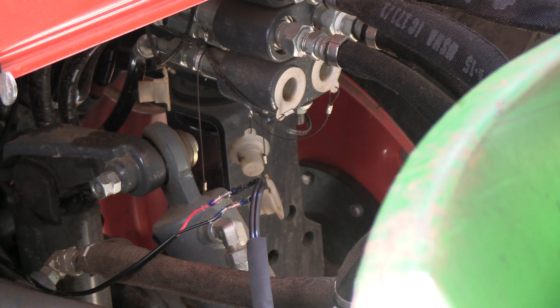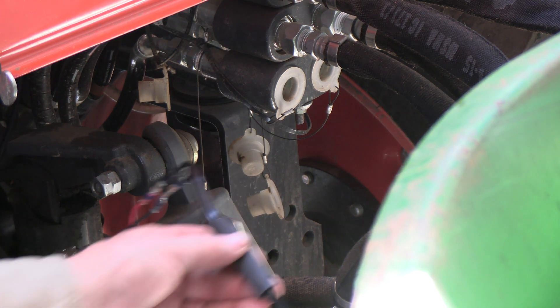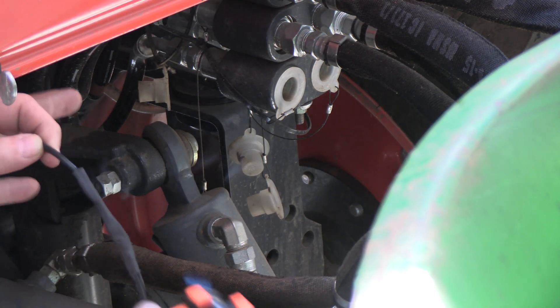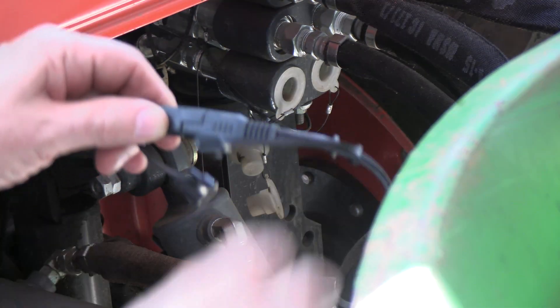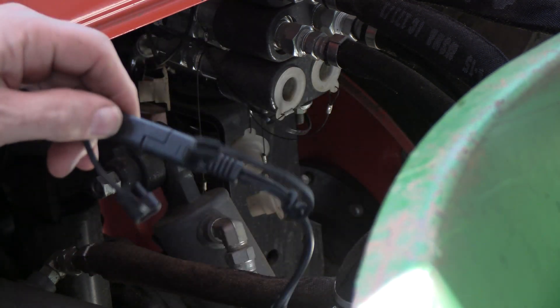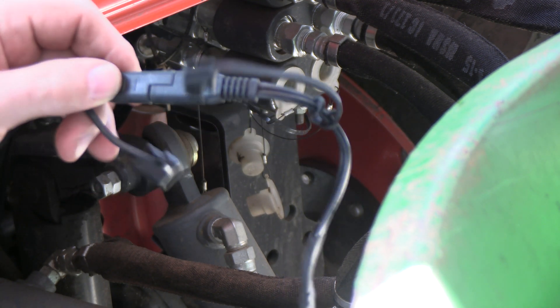I tested the connection to be sure that when I push the switch up it's going down, and down — it's closed at the first connection. Now I'm going to cover that with a shrink wrap to give us a nice seal, a nice waterproof seal. This is our quick connect, which has covers on it so the connections will stay without wasps, mud daubers, things like that.